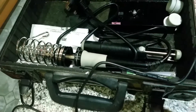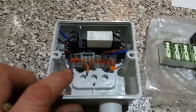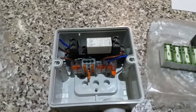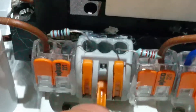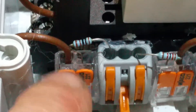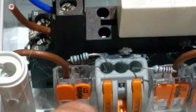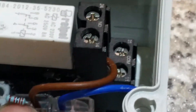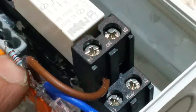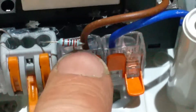Let me zoom in so you can see. We've got a central wago block — absolutely brilliant. This one connector has three clamps all joined together, so they're not separate circuits. This side goes through one resistor to one point on the relay — either normally closed or normally open. This one is connected to the normally open contact, so that's the 12k resistor.